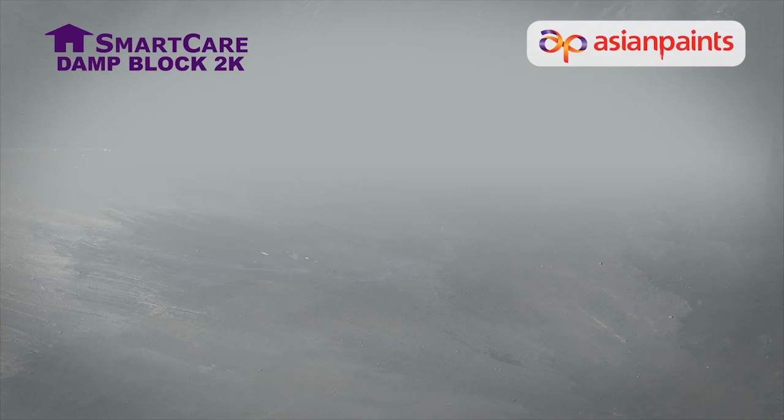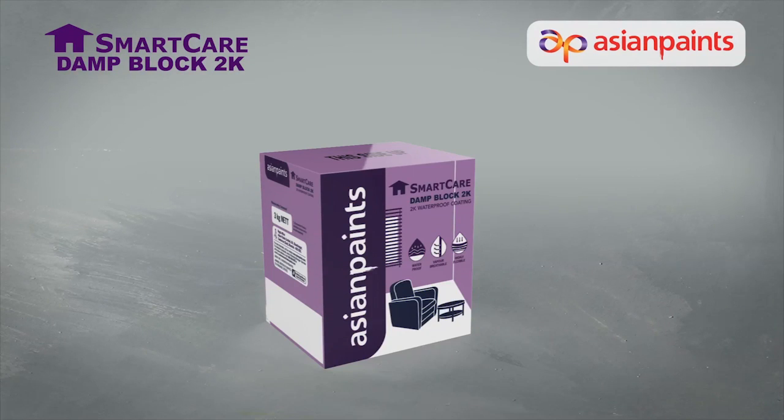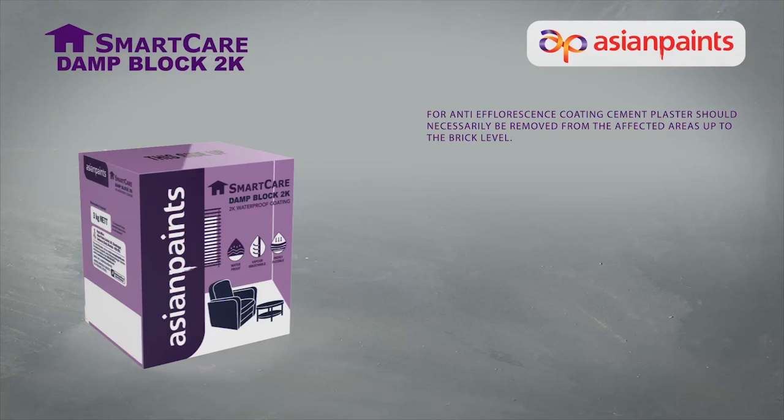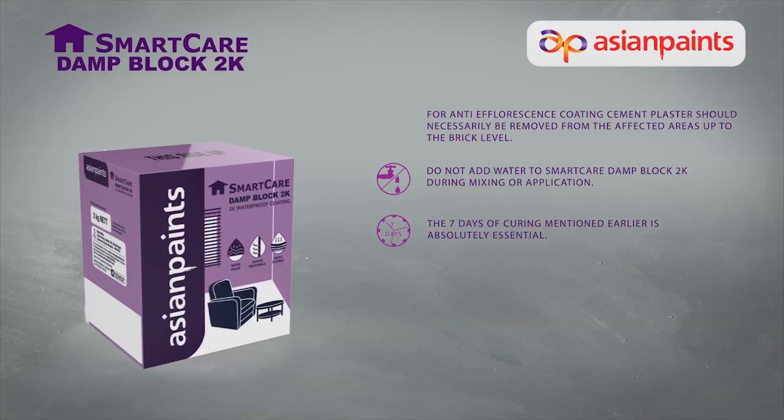While using SmartCare Damp Block 2K, certain precautions must be taken to ensure that the product is fully effective. These are as follows. For anti-efflorescence coating, cement plaster should necessarily be removed from the affected areas up to the brick level. Do not add water to SmartCare Damp Block 2K during mixing or application. The 7 days of curing mentioned earlier is absolutely essential, after which tiling can be carried out. Do not conduct any ponding test before the applied product gets completely cured.